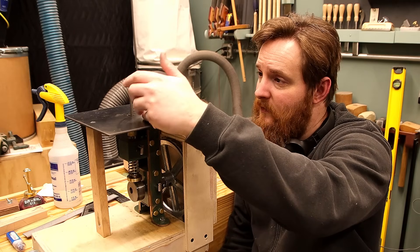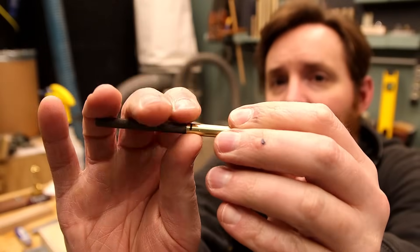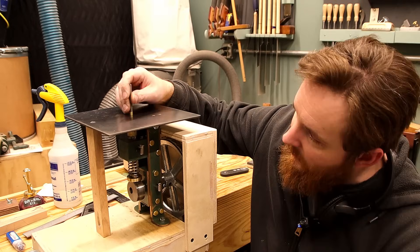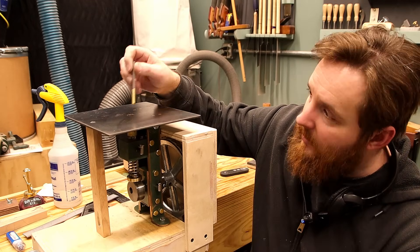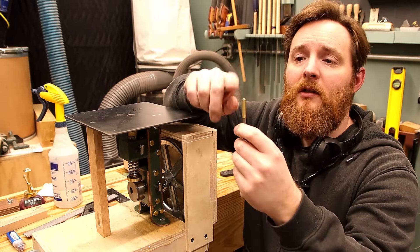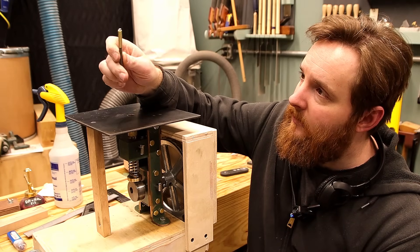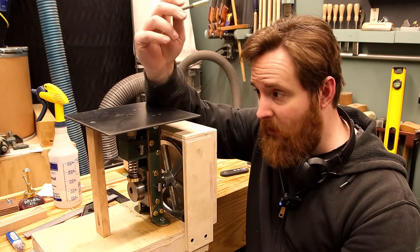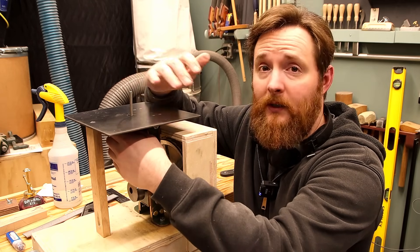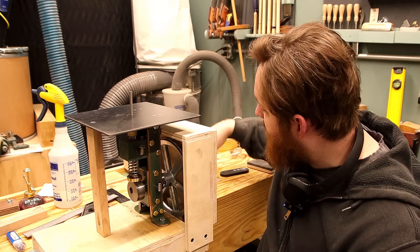This table is square to this file, so that's really all that matters. That's just a chainsaw file with a bit of brass tubing to make it fit in the collet. I just went ahead and stuck the file into a vice and then hit it with a hammer — that sheared it off right at the jaw — and then I JB welded the brass onto the file and stuck that in the lathe and turned it down to the correct diameter. That worked out really well and that will make getting files for this fairly easy.